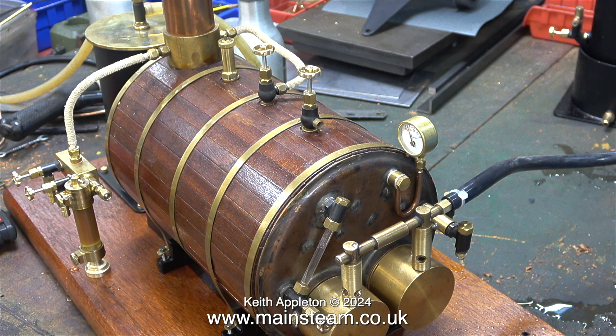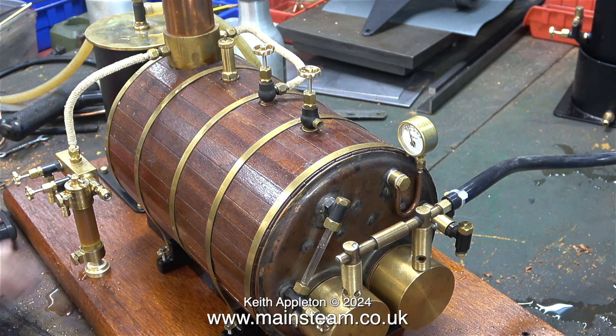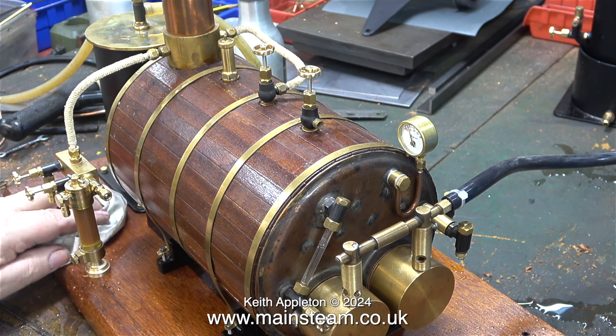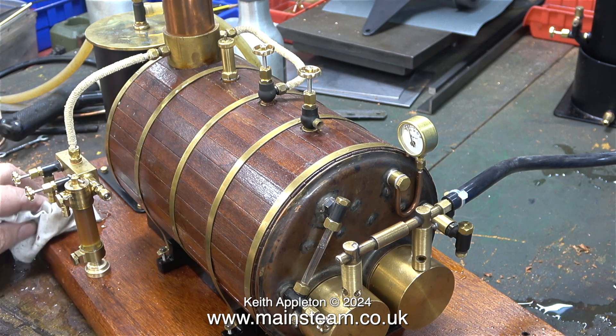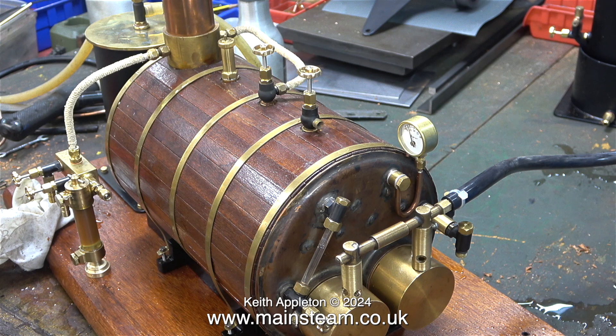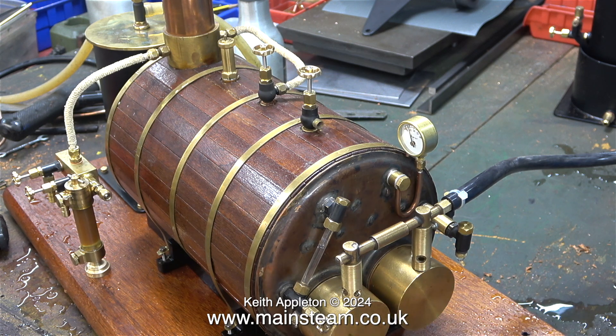I have found this to be an interesting experiment, but I'm puzzled why the boiler didn't steam well in the first place, as it is after all a commercially manufactured item. There isn't any pressure showing on the pressure gauge, but when I open the steam valve on the turret quite a lot of water rushes out because of condensation in the long steam pipe and the turret itself. There is a bit of a water leak from the check valve.